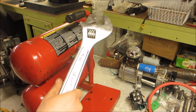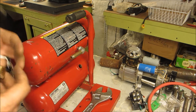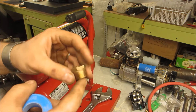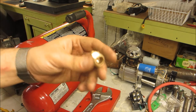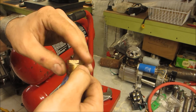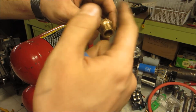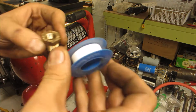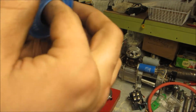I'm going to take a page out of AVE and use a large nut rounder — I figured I'd show you guys this. This is a fitting, a quarter-inch adapter basically, and I want to screw it in but I want to put Teflon on it. Righty tighty, lefty loosey, right? So if you wrap the Teflon going right it actually makes it tighter. If you wrap it the other way around when you're screwing it in, it makes the Teflon looser — so what you really want to do is make it tight. You don't have to go crazy with Teflon either.